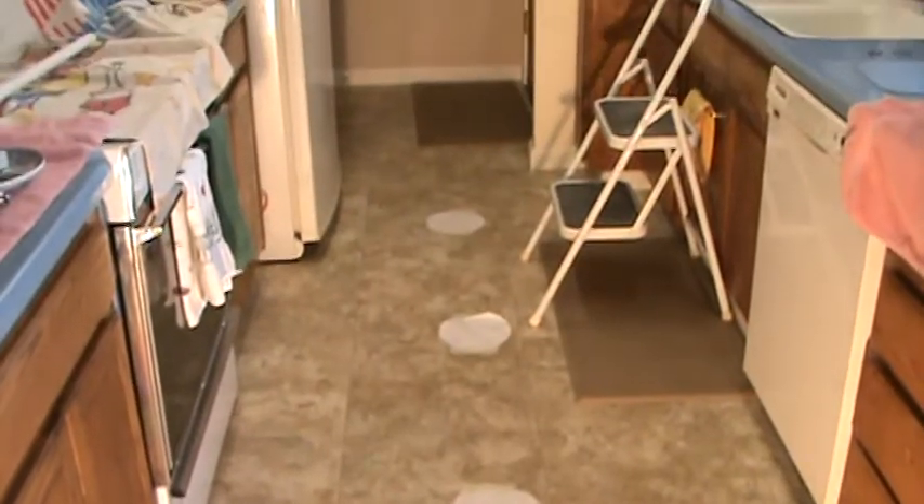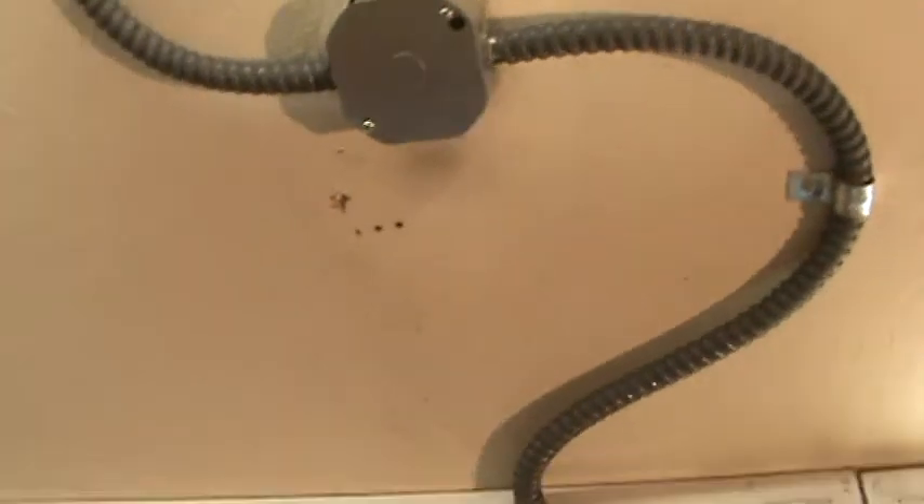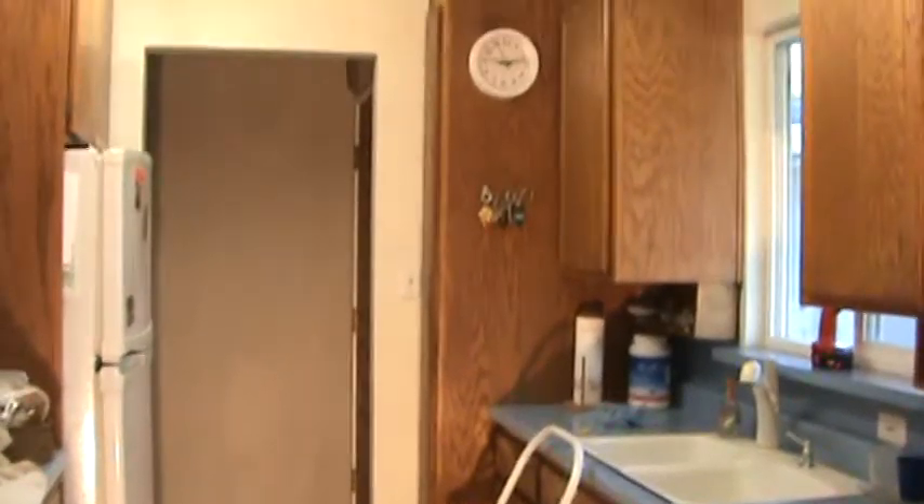We have a pattern determined up here. We know there's a ceiling joist right there next to that opening, and another one over here where we put sheetrock backing. There's a ceiling joist every 16 inches along this ceiling. I also crawled up in the attic to verify this. Obviously we can't put one of these lights where a ceiling joist is.